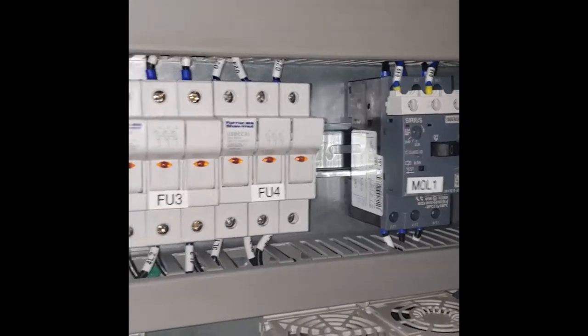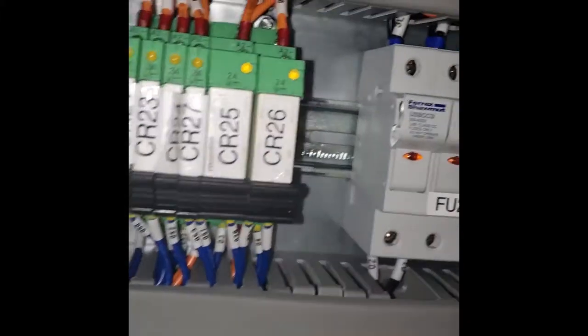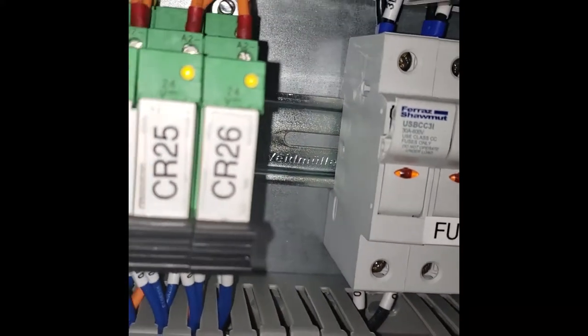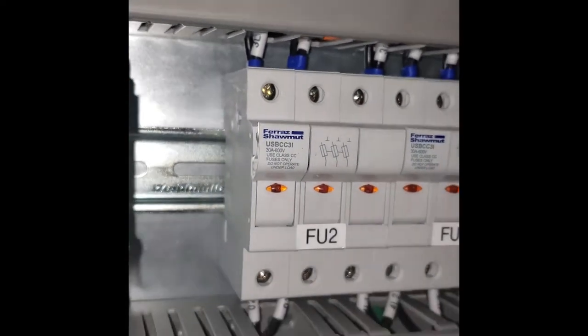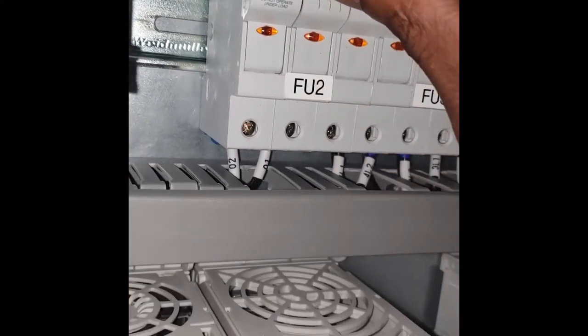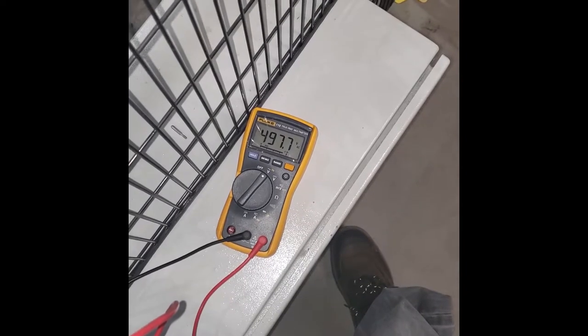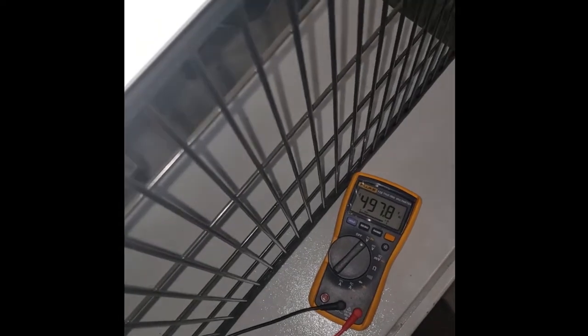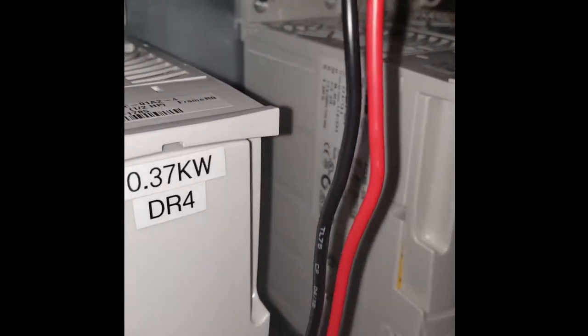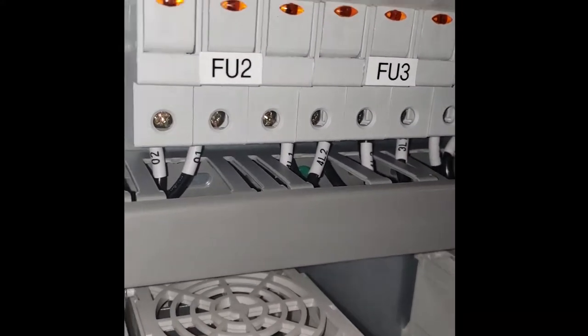This is our contacts and motor overload. When it comes to checking our voltage, we want to go from line to line. We want to make sure that we have our rated voltage — this is an industrial warehouse so our rated voltage should be around 480. It's plus or minus 10%, so right now we're at about 497, which means we're good. Let's check that line here — we're good.